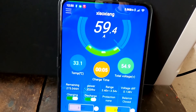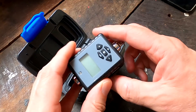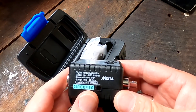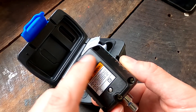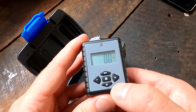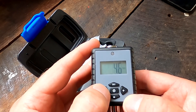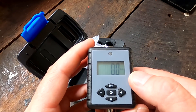60 amps outside. Guys, look at this — I finally got myself a little suitcase and a digital torque wrench I bought from AliExpress after a long time of consideration. With all these battery connections, it's better to be a little more consistent. This one runs on two triple-A batteries and has buttons at the front to turn it on and set a threshold. I've set it to five newton meters, adjustable in 0.1 newton meter steps.